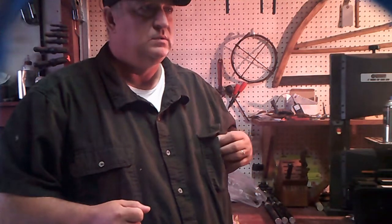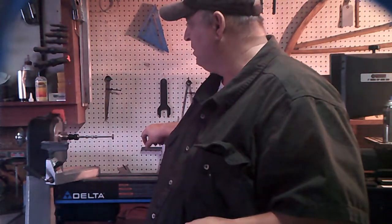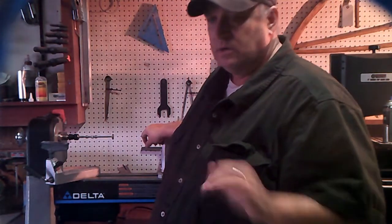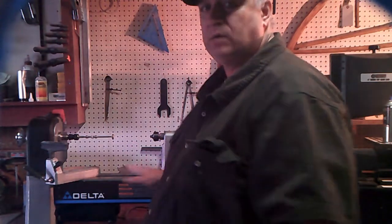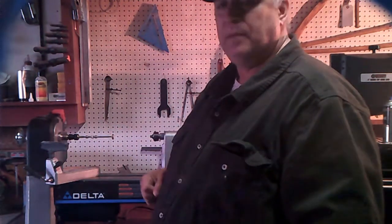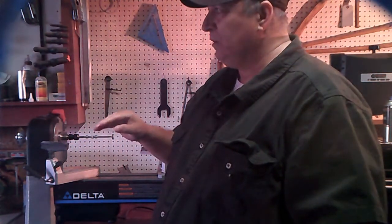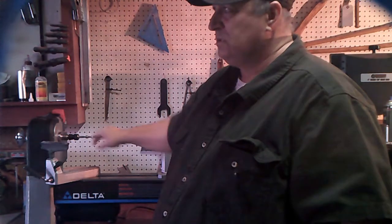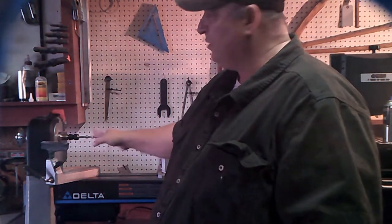Third thing is, when you're on the actual lathe, when you're doing acrylic, try to keep your tool at a 45 degree angle when you come across. It makes your shavings and everything come out a lot better. When you go straight in, like you would on woodworking and whatnot, it tends to chatter and chip a little bit. So keep it at a 45 degree angle,